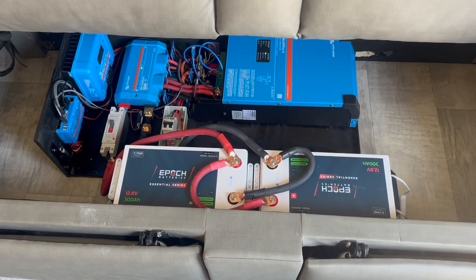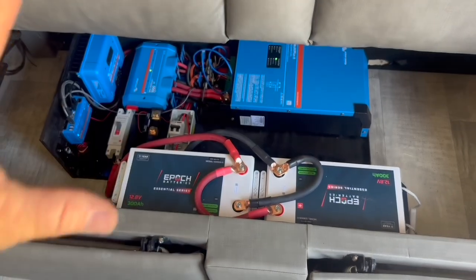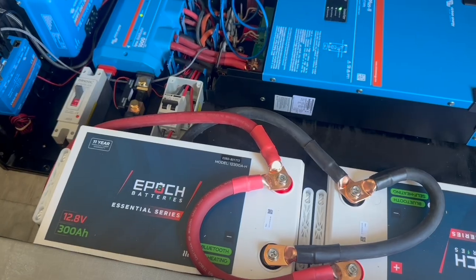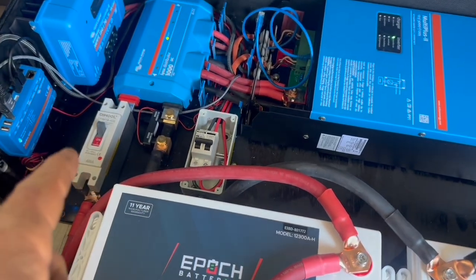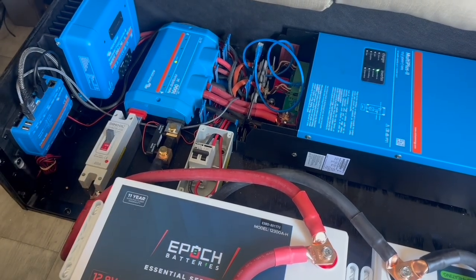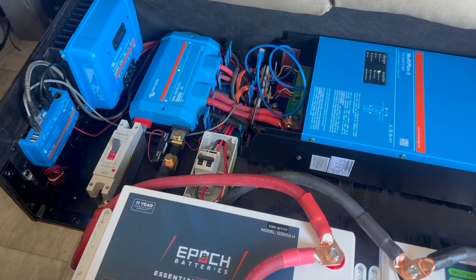You can see how things are laying out now — not complete, but we're in the testing phase. I want to talk about this because it guarantees we can catch problems as they arrive. Our standard procedure is one last double check before we even turn on that first switch — whether it's the breaker or the big battery disconnect switch. Double check all connections one last time: positive to positive, negative to negative. If it's good, then we throw the switch. First thing we're looking for is that green light. We did the hack so we're able to get the lights to go — we think it's awesome for customers to see at a glance that all their fuses are good, and if not, which one is blown. We do provide spare fuses for our customers as well, just in case they're out in the middle of nowhere and Amazon doesn't deliver there.